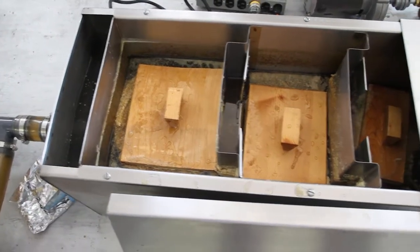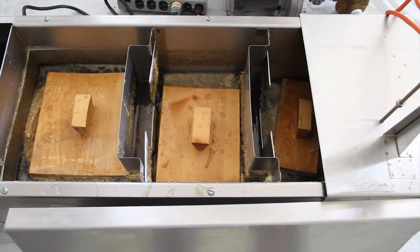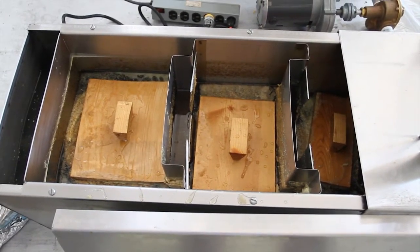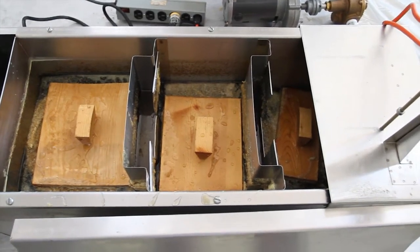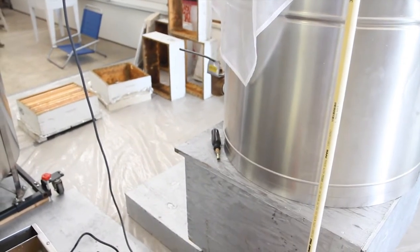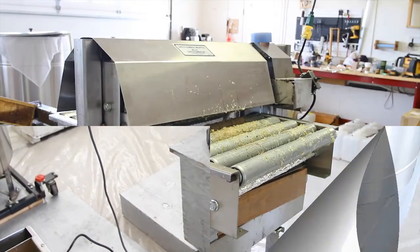The clarifier is a baffle system and it's water jacketed so it's heated to about 110 degrees. It helps filter out a lot of the wax. Then the honey is pumped into a storage tank and from the storage tank it's drained off. So we'll show you each little segment of that procedure now.